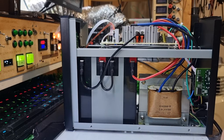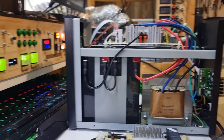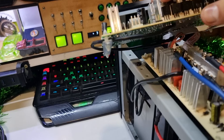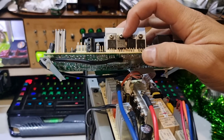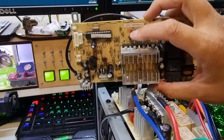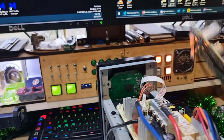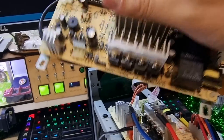Straight away I am noticing some differences between boards. This is our blown-up one. This is our old board - we have an LM317 here and a string of FP5N06s. There are seven of those, although this one is isolated, so I think it's a set of six. And you can see these ones royally blew their guts out - they're actually cracked off the heat sink.